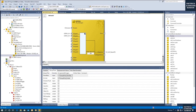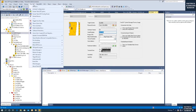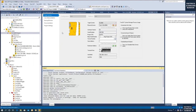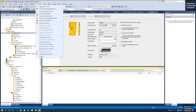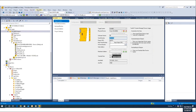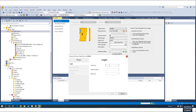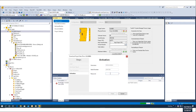Now we can build, verify the safety program, and download it to the safety controller. Let's double-check the serial number. First I'm going to build the entire project and then verify the safety project. Verify — no errors. Now let's download. Username: administrator. We need to type in the serial number, which comes from the target system. The serial number is 25672, then the remaining digits. The password is 'twinsafe' in lowercase. Click OK and type the password again — 'twinsafe'. We download without any error.